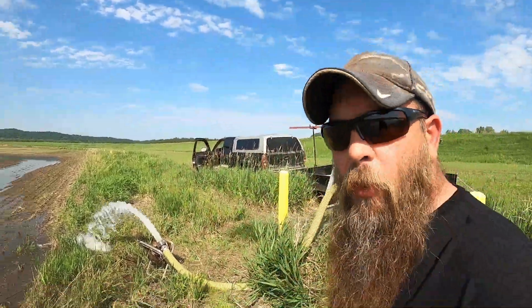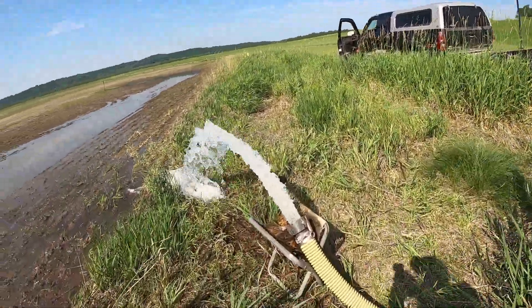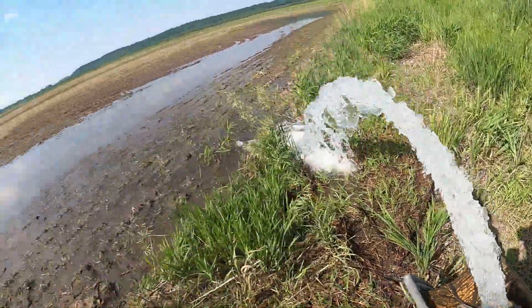We've been pumping on it for a while now and we've got relatively clean water coming out. We go from the top, drop down about halfway down the well and pump until we hit clear water, and then we go clear to the bottom of the well and do our bottom clean, then pull it up and let it pump until we hit clear water again. I'm going to try to video that happening and show you some of the gunk that comes out — we might not get a super close-up because I'll have to hold the pipe, but we'll see how that goes.